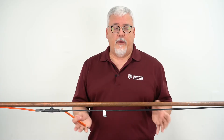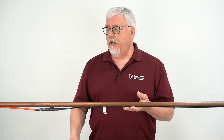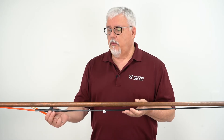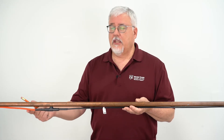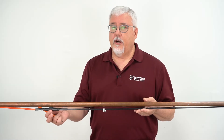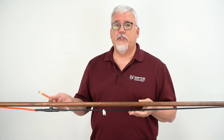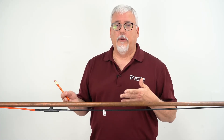What we have here is the cable that's going to be resting on the pipe at the bottom. If we take a look at this, we have the heating section here which is black, we have the switch section which is a thermostat, and then we have a non-heating portion here — this is the electrical feed to the switch to the heating cable. This piece will heat up when it gets below 37 degrees and will stay on until it reaches a temperature of 50 degrees and then it will shut off. So you can keep it attached to the pipe all year round if you'd like.